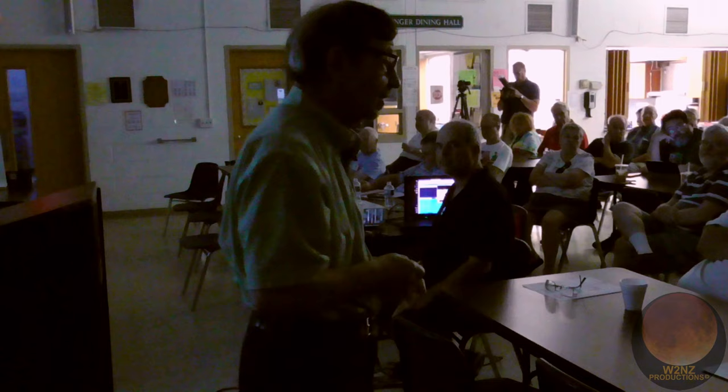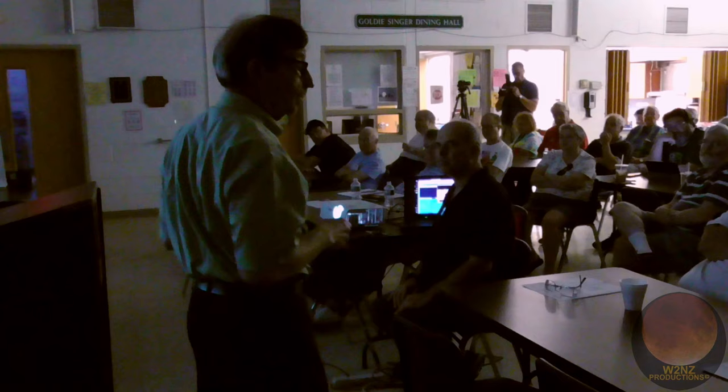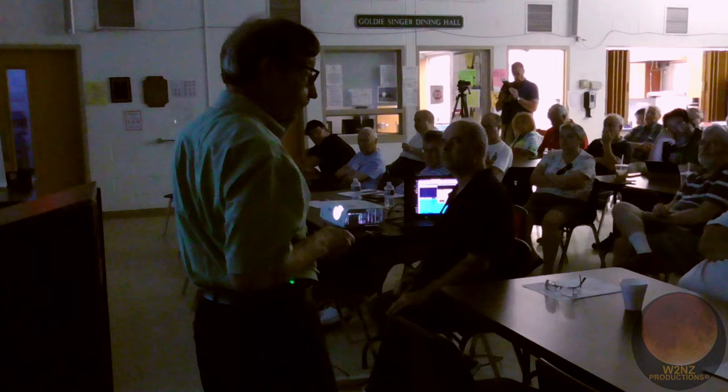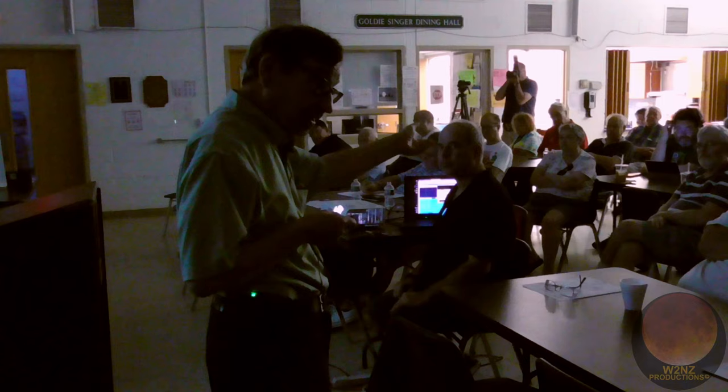So as you go higher in frequency, these shifts can be very significant. At 2 meters, if you operate 2 meter EME, it's almost negligible, okay? At 432, it's like 500 hertz or so. At 1296, you can get a couple kilohertz of change, particularly at the extremes, it goes out to 3 kilohertz. So at 1296, you definitely need to correct, because you'll hear the difference in the tone.